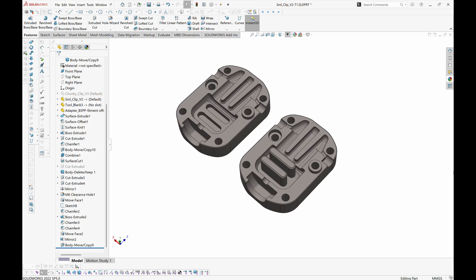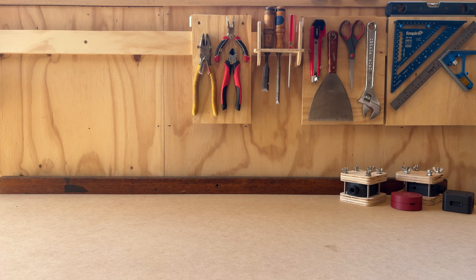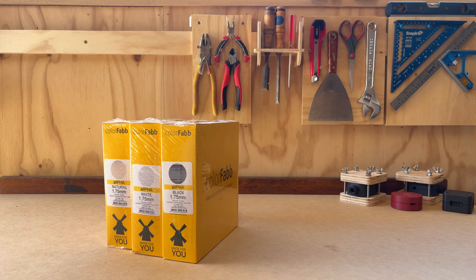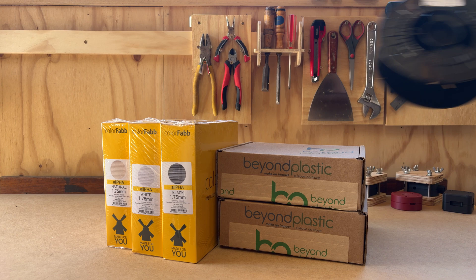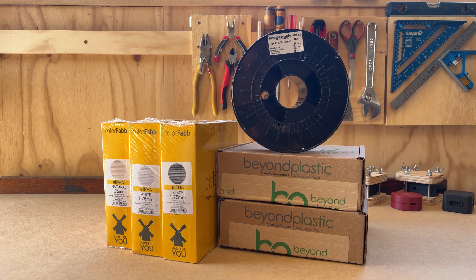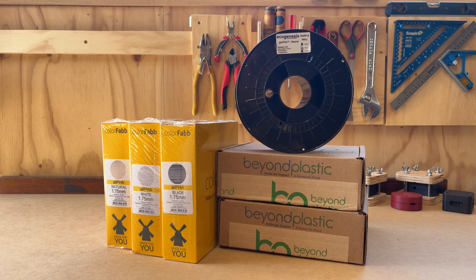Once you have a mould in CAD, you can export it as either an STL or 3MF file for 3D printing. In general, you need to use a 3D printing filament that has a reasonably high heat deflection temperature for the mould, because you'll be injecting it with molten plastic. I use PHA filament. I really want to dedicate an entire video to this in the future, because even though there are a million videos that already exist on 3D printing, I think PHA filament is underrepresented and a great choice for many applications. I use it widely as its compostability greatly reduces the guilt of waste from 3D printing. Managing warping is probably the biggest challenge, which can be addressed in a number of ways through both print settings and part design.